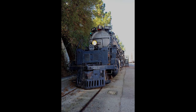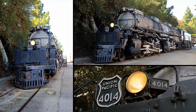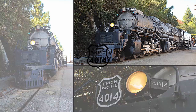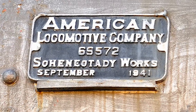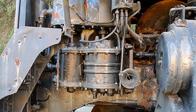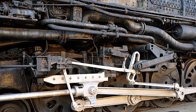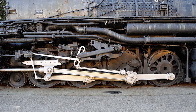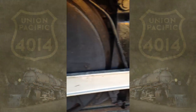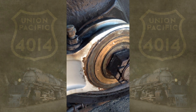The first 20 years of its life, it sat here in another location not very far from here, and the last 25 or so years it's been cared for rather meticulously as a display locomotive. Grease was inserted into all of the soft grease locations, and multiple times they actually put hard grease in the bearings — and you can see these bearings are actually in quite good shape.